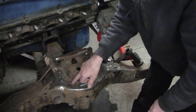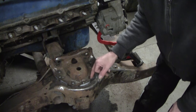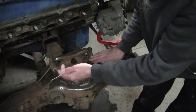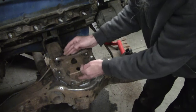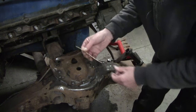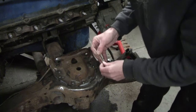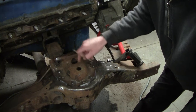When I did it, I ground off the factory hot rivets. That's what they use from the factory, is hot rivets. I ground those off, pried this up, ground off the stem piece of the rivet, and moved this over. Well, that left me all these nice little holes for plug welds. Now, on a plug weld, unlike a rosette, you start, I'll show you here, because I got a nice little hole right here where my shock comes through.